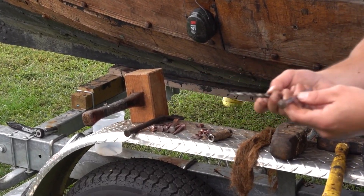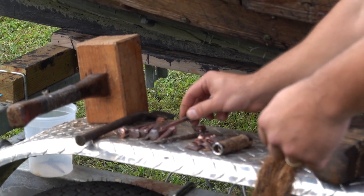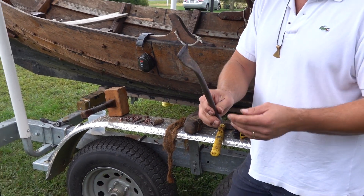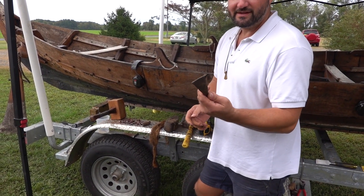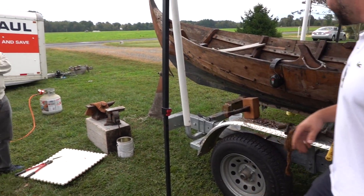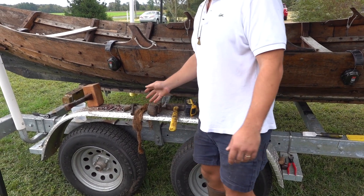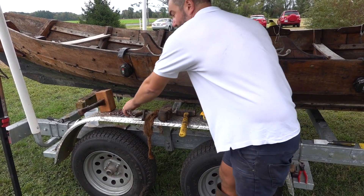So just be cautious. This is a caulking iron with a heavy, heavy bent — I actually modified it today because this one was very bent. But this is what I'll use to lay in the oakum into the seam itself. Going further down, we'll go through the anvil and stuff like that after. These are the tools we're going to use. Obviously this is not what they would have used in the Viking Age — it would have been a bow drill with a spoon bit.